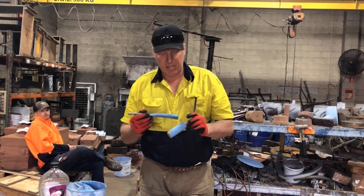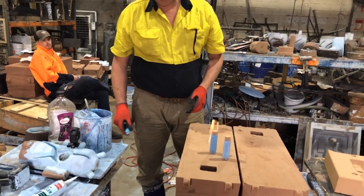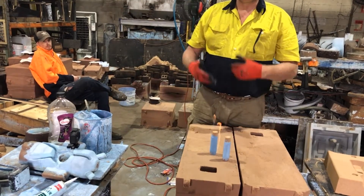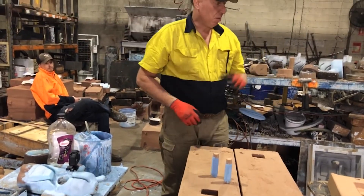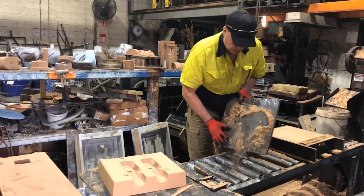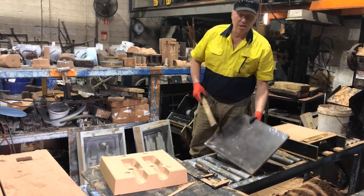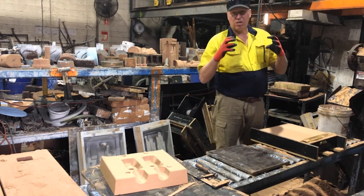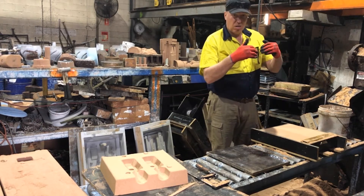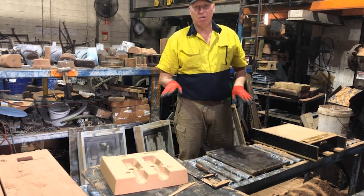That's the core painted. The old trick of setting the paint — I like to dry it off with a flame. I wouldn't try it on your house paint, but it just helps dry the foundry paint quicker. We'll go back over to the other mould to finish the core box. I like to make sure all the surfaces are flat, because a lot of sand moulds stay flexible for a while. If you put it on a surface that bows, they won't fit and you'll get flash or metal coming out the side of your mould.